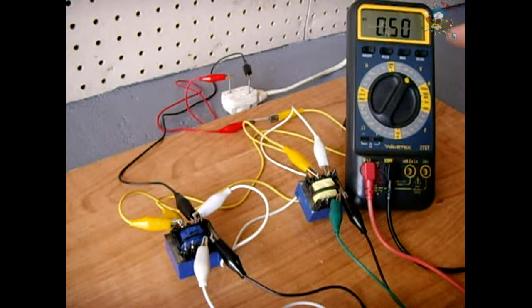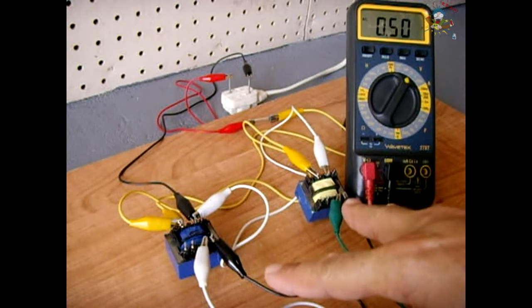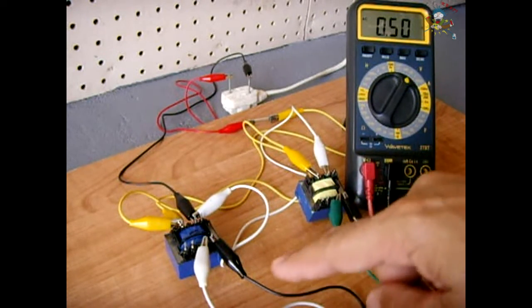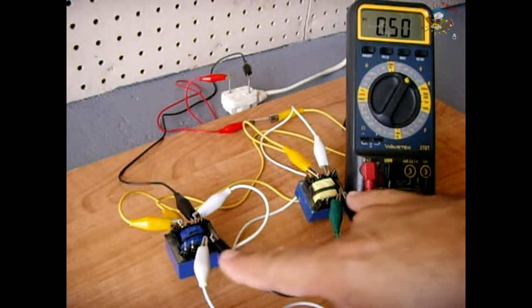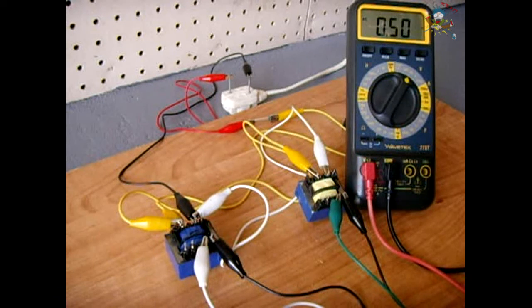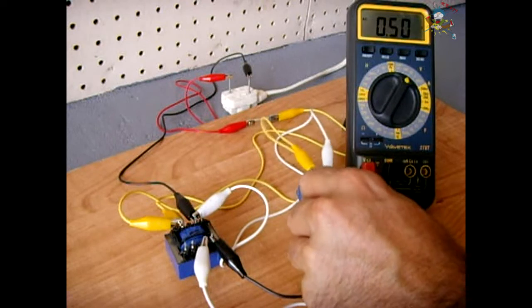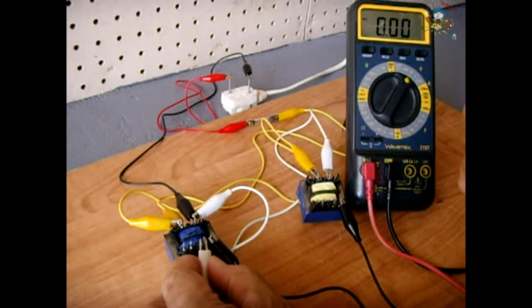We're right around 0.5 and that's pretty close to the difference between these two transformers, so we're good. If you had connected the black wire to a different pin and saw double the voltage — around 29 volts — you do not want to parallel that pin with that pin. You will end up with a 29 volt short circuit. So we're good at 0.5 or less. Since we confirm we're on the right one, it's now safe to join these together. You now have double the current output at the same voltage by using the two transformers.